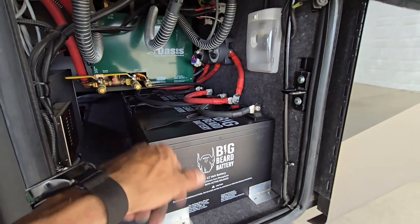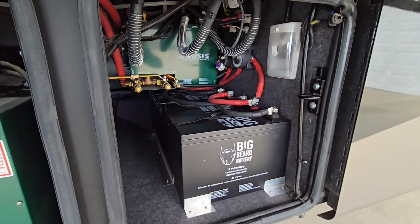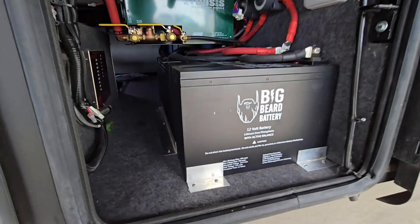All these batteries do have power buttons, so you could almost skip the battery disconnect. But the third and fourth batteries' power buttons are really hard to get to, and it's nice to be able to easily bang them on and off. So I put in cutoff switches there. For 24-volt batteries with breakers on them that are easy to push, as long as you can get to the battery, I don't put cutoff switches in.